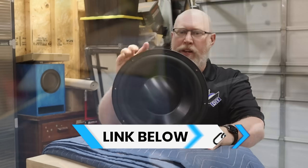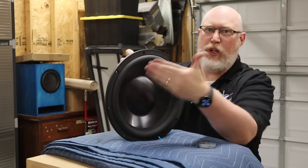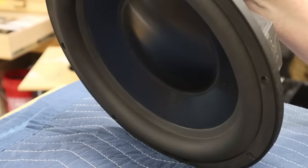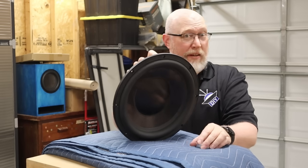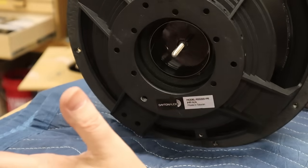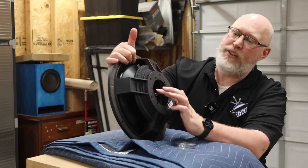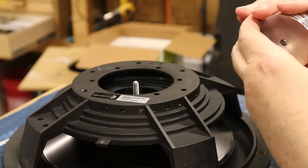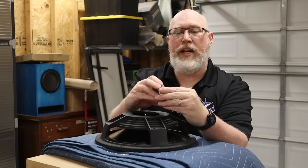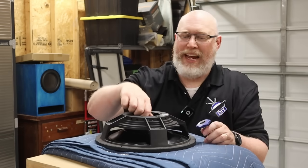This right here is a passive radiator. A passive radiator is basically a complicated port where the size of the cone is the port opening — so basically we're dealing with a 12-inch port here, which seems like a lot for an 8-inch subwoofer, but it is what it is. To tune the passive radiator, you add mass to it — that's the functional equivalent of making a port longer. There is a screw on the back of the passive radiator, and they typically ship with some weights. These are supposed to be 75-gram weights, and as best I can tell I'm going to need four of them. 75 grams is about two and two-thirds of an ounce in Freedom units. This is one of those nyloc nuts that won't back out — that's handy.